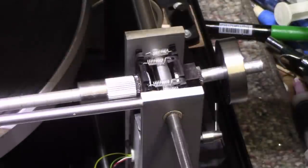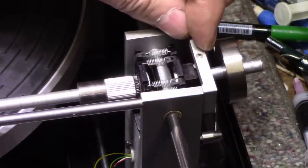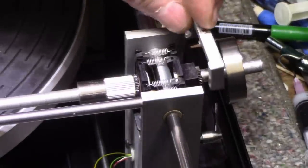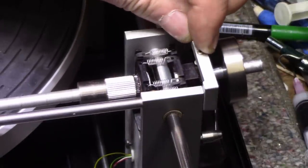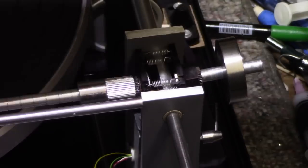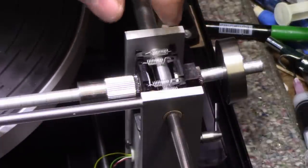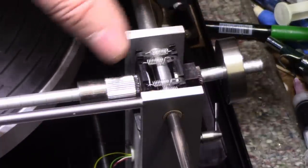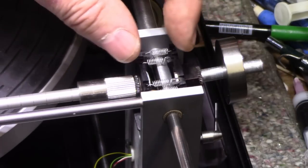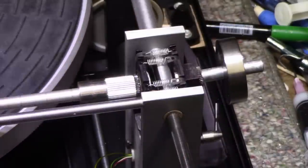But when I put this on, you can see it. Now I crank the screw way in, and now it's starting to work. But, oops, be careful here. So, yeah, that's a problem with these old turntables, is this plastic is fatigued, I think, and been pulled in for over 50 years of those springs pulling. I think it's kind of collapsed, and everything's gone out of whack here. So I'm just going to have to adjust for it.